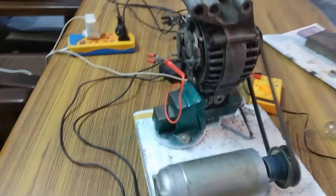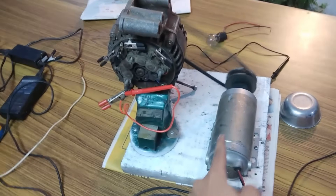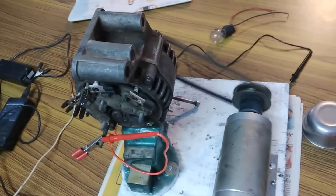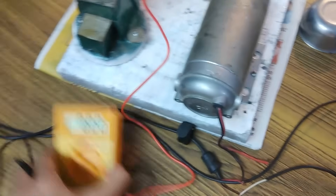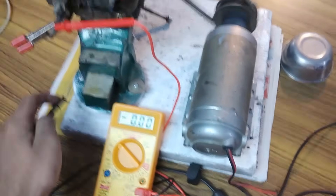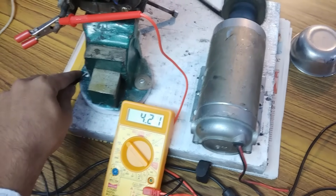I will show you the operating view from the back — look, no other connections are provided. The entire system is like this: the only connection is to the DC motor, which is connected only through the belt to the pulley of this alternator. Let me show you the generated voltage again with the multimeter — touching the terminal to the body of the alternator. Yeah, the entire vice is also at negative polarity. It is generating electricity without its field being externally excited.